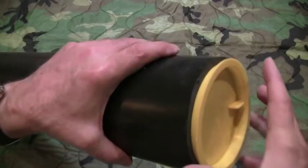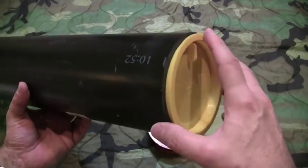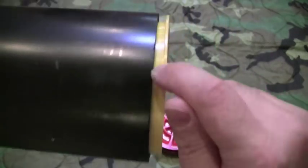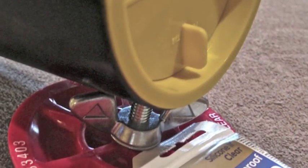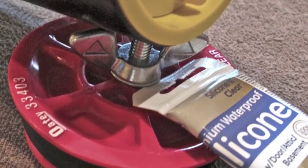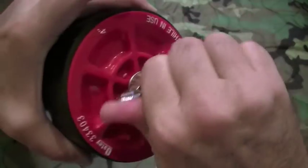There's not much to building this tube. The ABS is pre-cut — I bought it at the home store just like that. I put the cap in leaving a gap, filled that with caulk, pushed the cap down, wiped off the excess caulk, and that end's done. The other end is real simple: you just put your test cap in and cinch down the wing nut. That makes a water-tight seal. You're done.